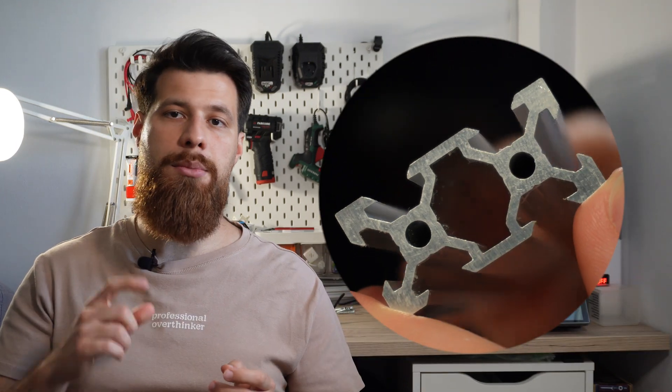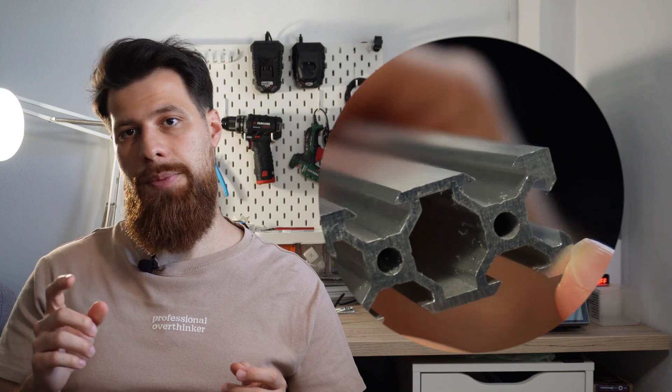For the cantilever we had two options. First, use the 3D printer and print just the holders - that would mean a very big print, at least bigger than my machine can print. Second, you can use an already existing aluminium profile, but this time 20mm by 40mm, so that you'd have more mounting points for future accessories. The 20x40mm extrusion can be in any length. Initially I thought it should be 20cm, but after fiddling with it I decided to go with 25cm. In this way the filament stays a bit lower, giving it a lower center of mass and making it less likely to fall.